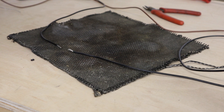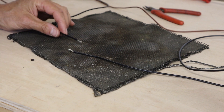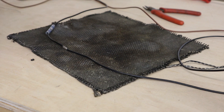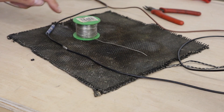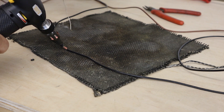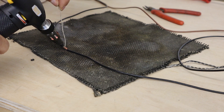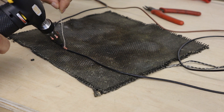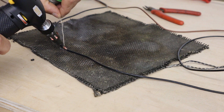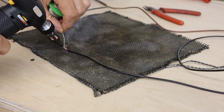With these black wires I'm going to do this what I would say is the preferred way. I'm going to start putting the butt connector over one of the wires, same as before, and interlock these wires together ready for soldering. I'm going to pre-solder these with some multicore solder — multicore solder has flux which will allow the solder to flow very nicely in between the strands of the wire. You could do this with a regular electrical soldering iron; I'm just using this gas-powered one because I happen to have it handy. We're getting lots of good flow of solder in between the strands of the wire, which is what's going to give us a good strong joint.